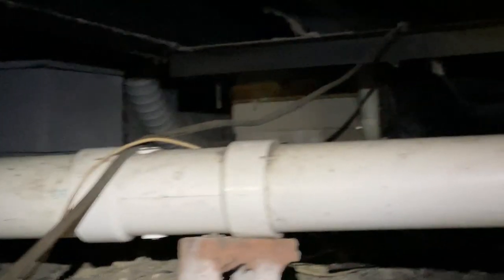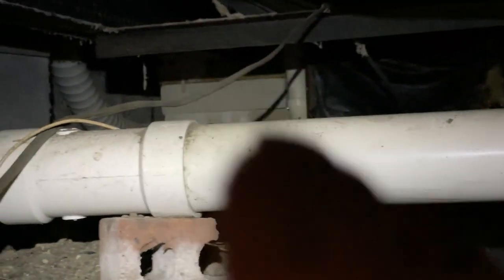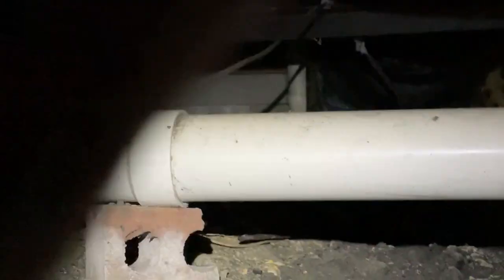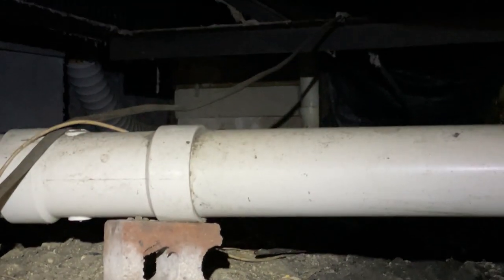There's water leaking out up under there. Down there you'll see an exhaust vent — that's where our laundry is, right there is the drain. So somewhere in there we have to open up that part of the ceiling so they can put drops down for me and I can tie them in for the laundry. Then straight across on the other side is where the kitchen is.